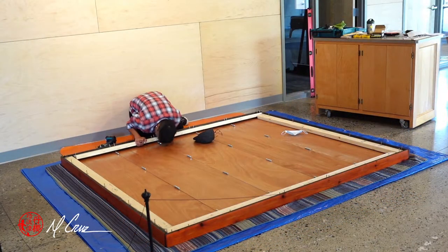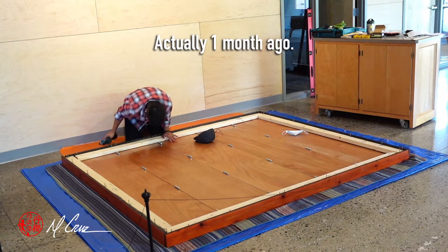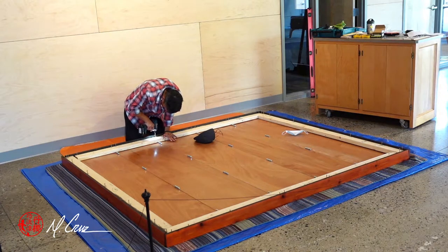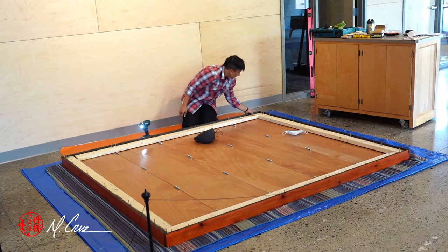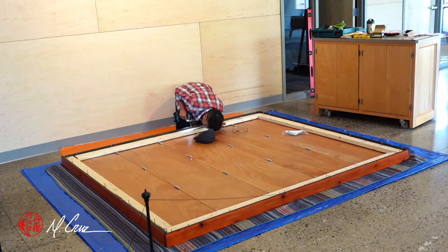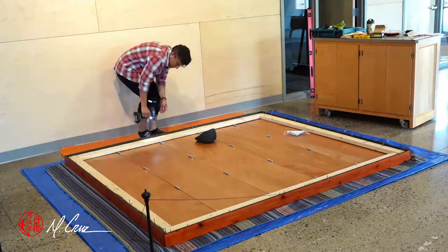I'm lining up the holes for the screws as I work on this particular piece of the frame. I'm reminded of the test run I did two months earlier — good thing I did, because I found that piece had warped. The pine 2x4 had warped tremendously and I had to redo that piece. I didn't want to redo the cedar because of the color and stain — I knew I wouldn't get it the same — so I had to get my Dremel Max out to cut through the glue. I had used a nail gun and glue to put it together, so that was pretty messy, but this is why we do tests and it all worked out in the end.